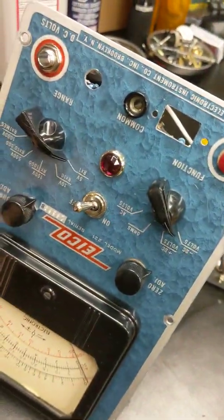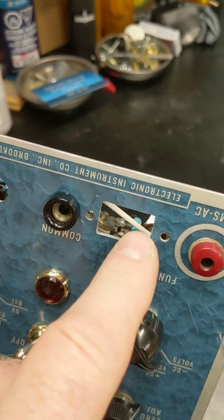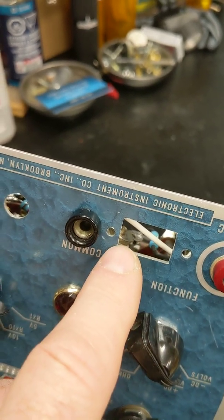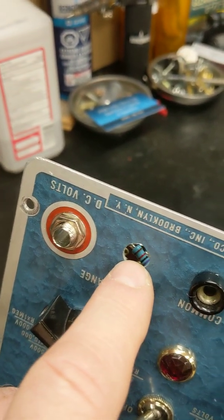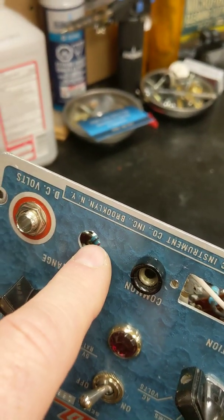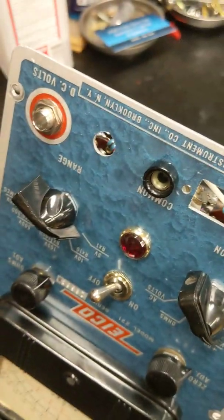The other thing that I noticed, I had showed you guys as upside down, but this was a hole that wasn't supposed to be there, and the guy had put a slide switch in there. And still deciding what I'm going to do with that. I might see if I have a piece of brass I can polish and insert from the back side with a couple of brass screws just to clean it up. But he also had this hole, and what he had done was he had added a second jack, 1/4 inch jack, right here, and he was using this switch to change between this jack and this jack. I don't know why he was doing that, unless there was something wrong with this jack. There's nothing wrong with the jack itself, but it's very well possible that the whole thing was wired incorrectly, because it was wired incorrectly.